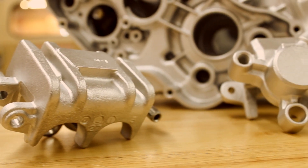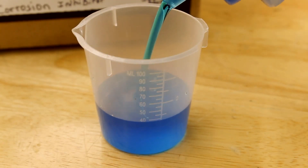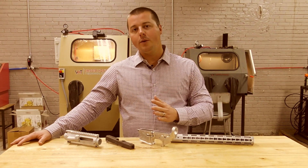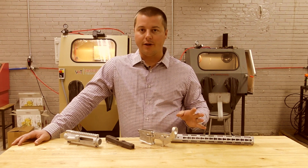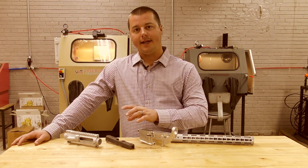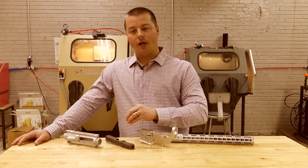When you get to a steel part, you need corrosion inhibitor. Corrosion inhibitor is fine on aluminum — it's not going to hurt anything. It's just going to protect your carbon or ferrous metals from flash rusting, and it's going to do nothing to the aluminum. You can still coat after a corrosion inhibitor. A lot of people have the misconception that if you add corrosion inhibitor to the machine you cannot coat — we do it every day. Black oxide coatings, Cerakotes, any thin film coating, PVD coatings — we coat after using the corrosion inhibitor. That's what it's for: to allow you enough time to get your part coated and protected.